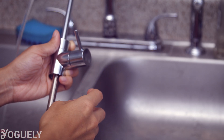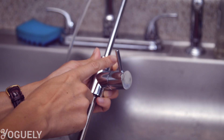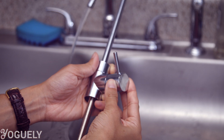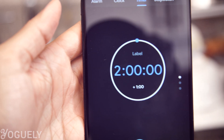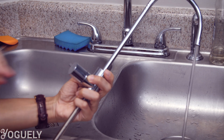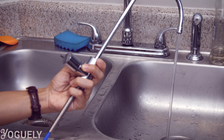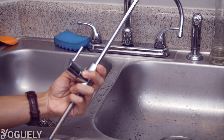To wrap things up: thoroughly rinse the membrane by letting the faucet drip for one hour. Then close the faucet and let the tank fill up for two hours. Then open the faucet and let the tank empty — it will empty faster than it fills. Then let the tank fill up once more, and it's ready to use.